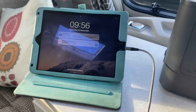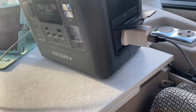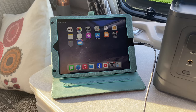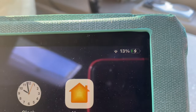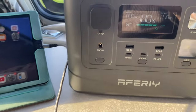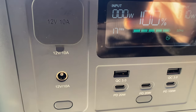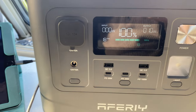I've got the iPad that needs a charge — so that's plugged in on the side of the unit. Even with these strange-shaped adapter plugs, I don't seem to have any issue getting the iPad plugged in. Power it up from the side by pushing the button. So we've got power going into the iPad — I know it's now charging because we've got the little flash of lightning through the battery. It's only at 13%, so it does need a good charge. In terms of output, that's using 10 watts of power. If we just kept that plugged in all day long, we're okay for 17 hours. You can charge the power bank and be charging items from it at the same time.